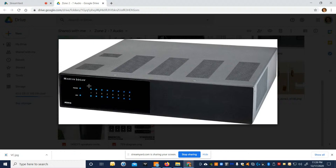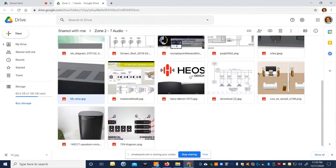The cool thing about these Class D amps is they actually double down on power with lower load impedance, unlike cheap amplifiers that collapse at 4 ohms. I did a video on that $100 Sony receiver — it will collapse at 4 ohms. Marketing-wise, companies like to say '16 times 100 watts' at 4 ohms, but most in-ceiling speakers are rated at 8 ohms and don't dip their impedance a ton, so that 4-ohm spec isn't as relevant in practice.